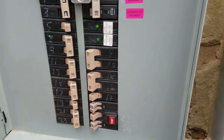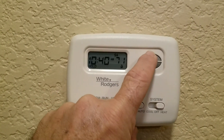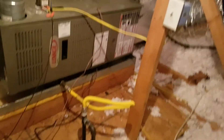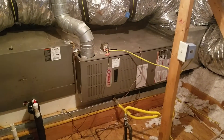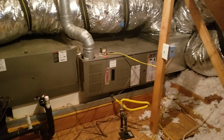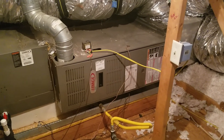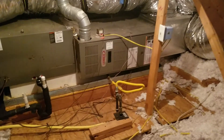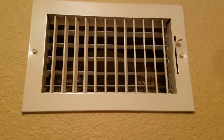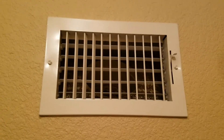Turn the breakers back on. We're going to turn the thermostat on and check the heat, turn on the power to the unit. The flame is coming on — propane gas heating up. And the motor turned on. New motor — you can barely hear that thing turn on, that's nice. Let's make sure we've got air coming out. A nice glow coming out. Took about five minutes maximum, just walking back and forth, cleaning the breaker and switches, and remembering tools. And it cost me seven dollars and fifty cents.